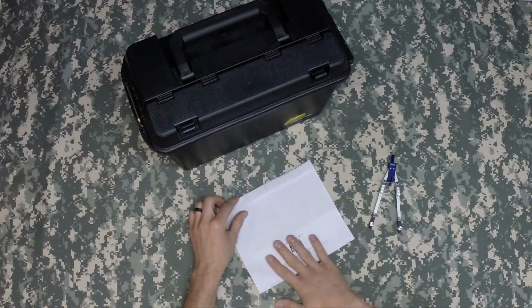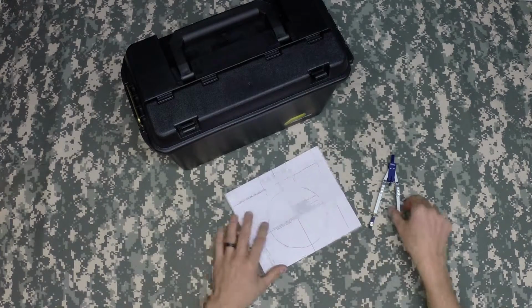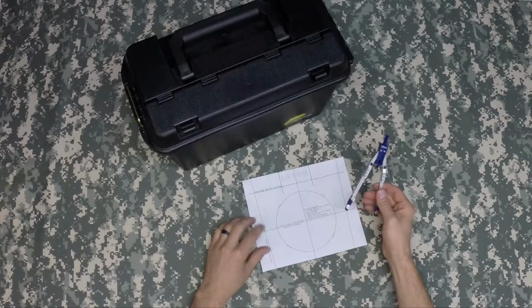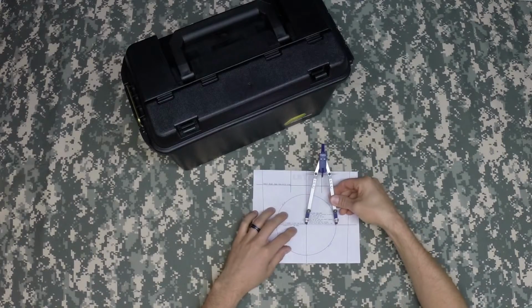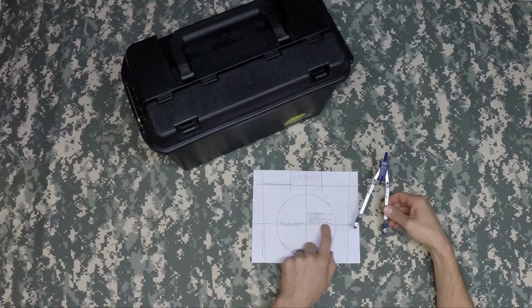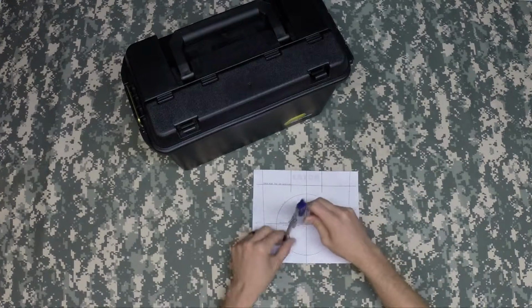Once both lines have been folded, you need to flip down the bottom flap. You'll use that as a guide on the box, but let's first go ahead and set our drafting compass. Place the drafting compass on the pattern and set it according to the measurements shown. You do not need a ruler, as we already figured out the measurement to make the appropriate hole size.